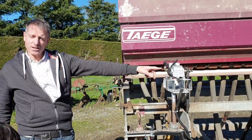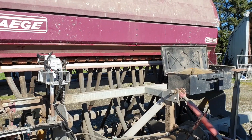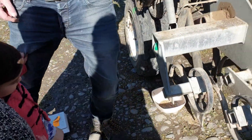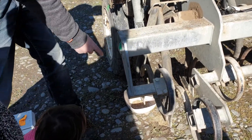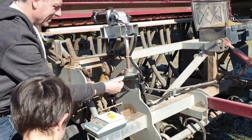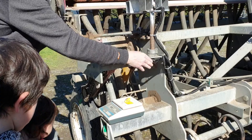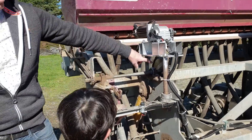And the system takes over the 10 turns of the motor. We could catch the seed out of all the pipes, but in this case we're just going to do one pipe, and whatever weight comes out of this one we'll multiply by 23, which is the number of pipes. And the motor will stop when it's done.